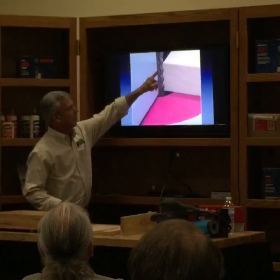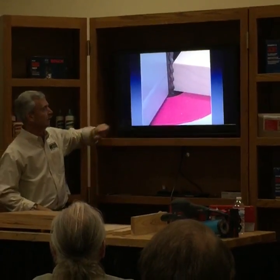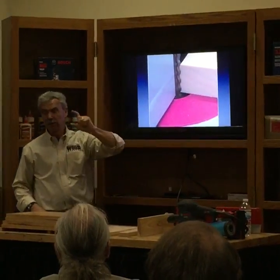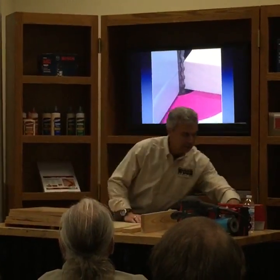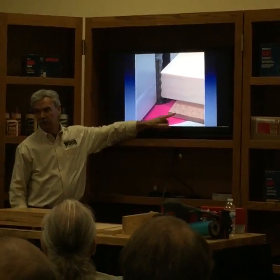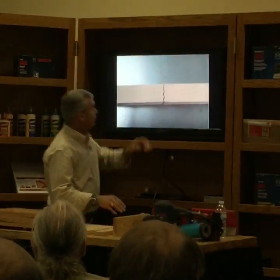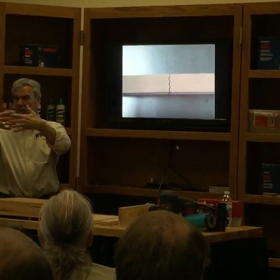This is the wavy edge here. It creates a convoluted little edge, a lot more glue surface area here. The space between the height of these cutters is about 1/4 inch. So you run board A past there, and then you run board B past there, sitting atop a 1/4 inch piece of tempered hardboard. So it makes up for that difference. What it does is it allows you now, when you lay these out, to have a lot more glue surface area when they go together.